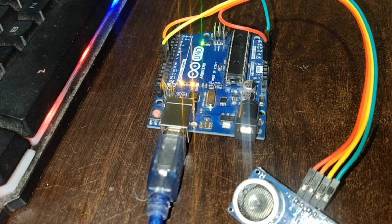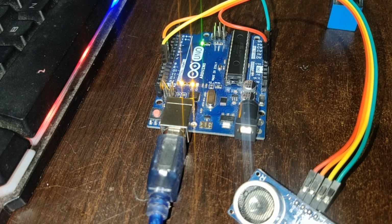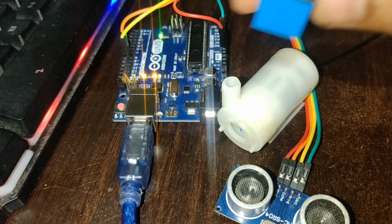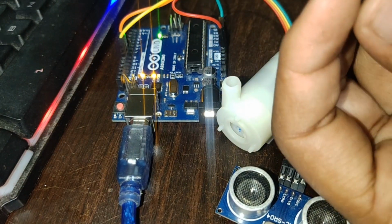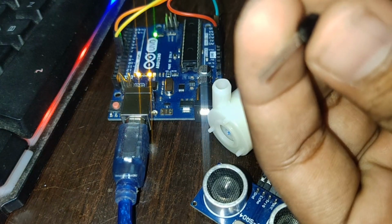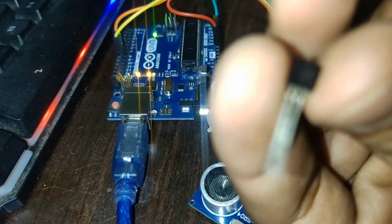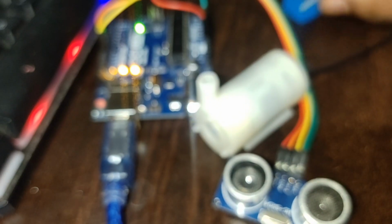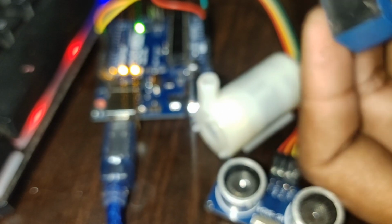So now next comes the relay connection. For controlling this motor, we have to use a relay. For driving that, we have to use a transistor like this, a BC547 transistor. I'll give the link to purchase this in the description below. Now we have to do some soldering for this relay. I'll show you how to do it.